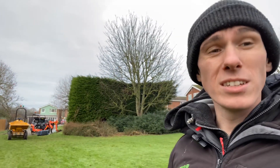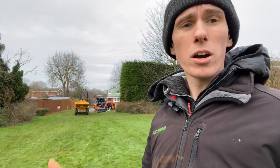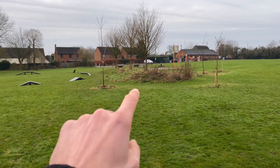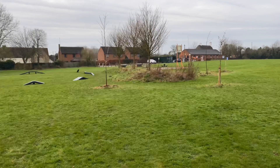What we're finding is a lot of water logging happening where the ground is dipped all along here. When water has got nowhere to go, it will go into boundary properties, so back gardens are getting flooded. Essentially what a French drain does is stop water logging — the water seeps through the ground into the French drain and dispels it somewhere else, either to a ditch or to a soakaway system. On this project we're installing a soakaway system hidden in that bank there.